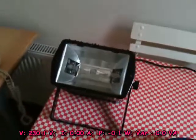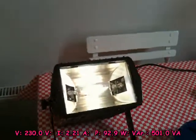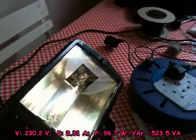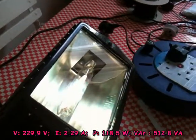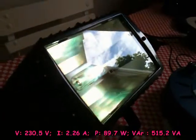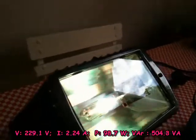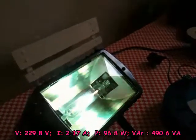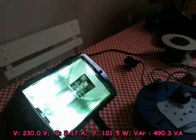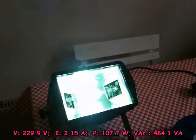We're just going to start. The lamp's ignited and it's giving this sort of slightly yellowy, creamy green colour just as it gets going. Drawing not terribly much power at the moment — 90 odd watts, 100 watts or so — but has a very, very poor power factor indeed. This is because the lamp itself is virtually a short circuit, there's very low voltage across it.